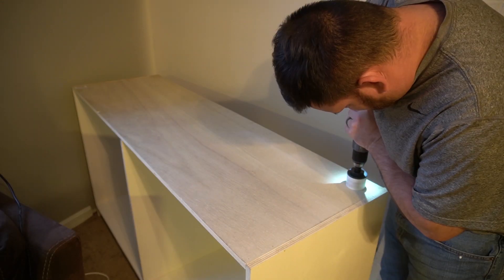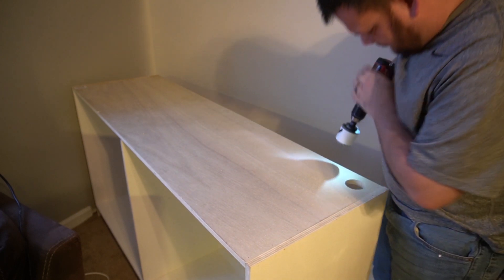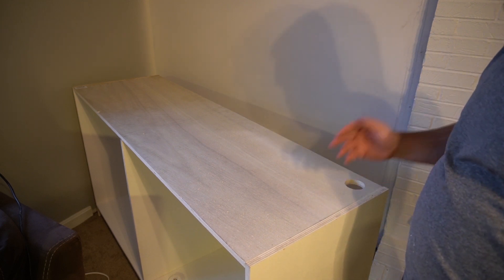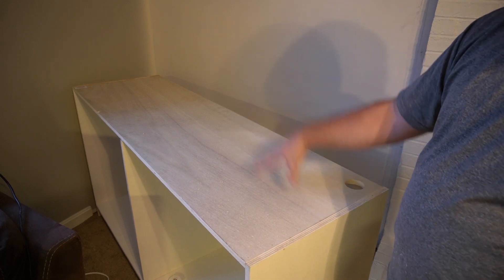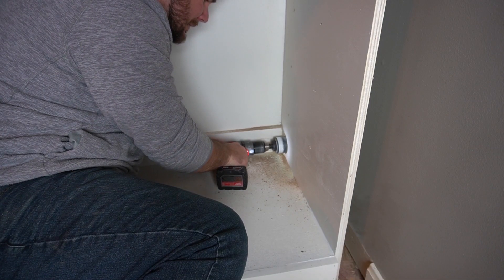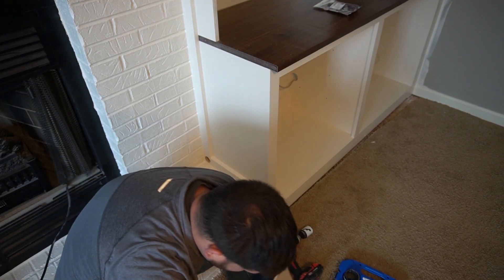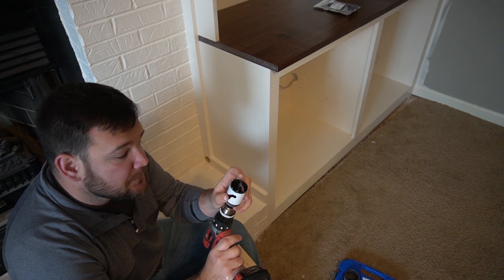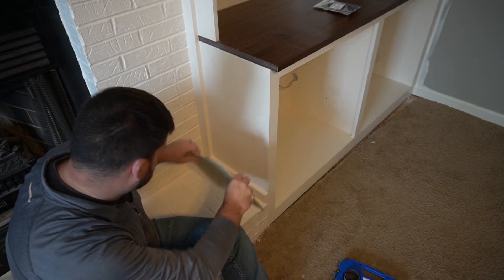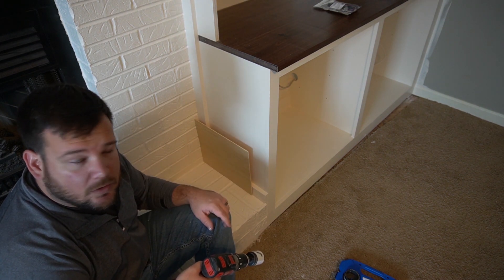We had to think through our cord management. Basically we're going to drill one hole in the top, and the receiver, internet, and all that stuff is going to sit right here with all the cords running down. So when I get the countertop on here I'll have this hole. It would have been easier to drill them both at the same time, but I've got to get everything in place and cords in place before I can get the walnut top on. This was kind of a pain point — figuring out where to drill holes, where those cords need to go, what was going to sit where. Some forethought would have made this part go smoother. The hole I drilled was too small. My trick with hole saws is to put a thin piece of lumber in front of the hole, tack it in place, so the pilot bit sinks into it and you can get a nice straight hole all the way through.